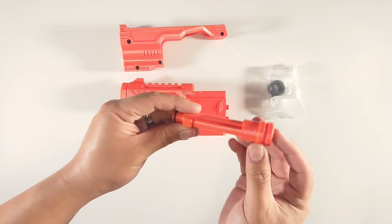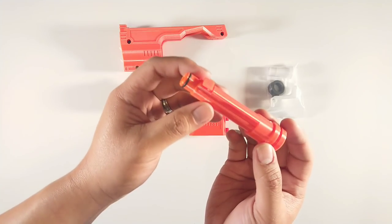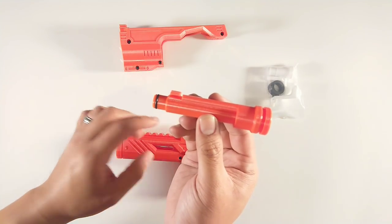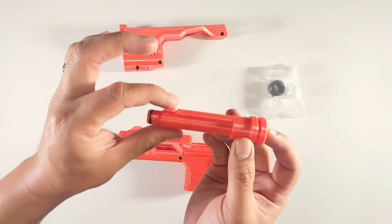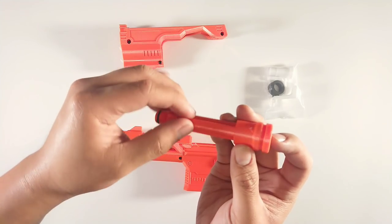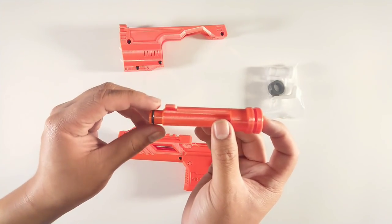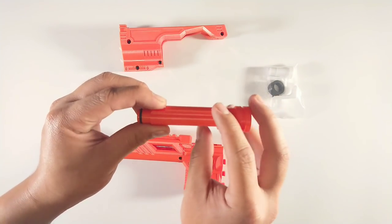Let's take a look at the insides. This is the brand new bolt that it's going to come with. One of my concerns about this bolt, having worked on many Sharp Fires, is this nub piece right here, which works out fine in a Sharp Fire even at high spring loads, but I was concerned what might happen to it if it's 3D printed. So he made it really wide, but also added this spine to the bolt, which really helps to support it.